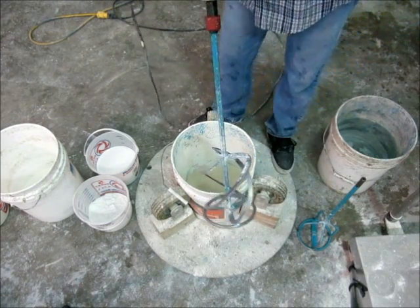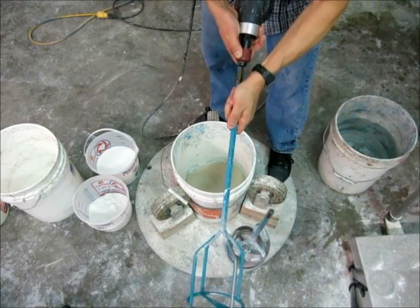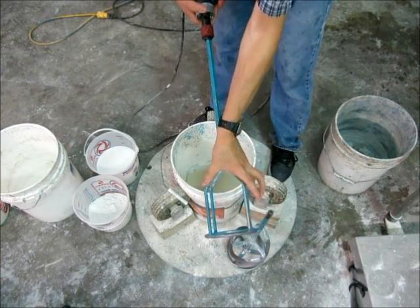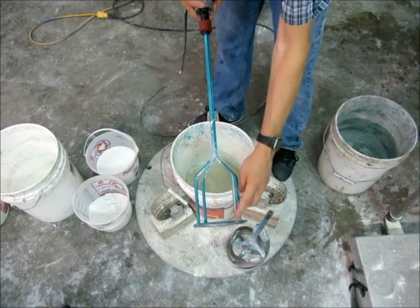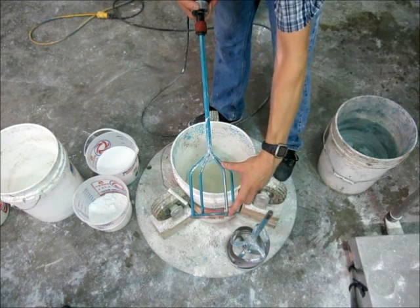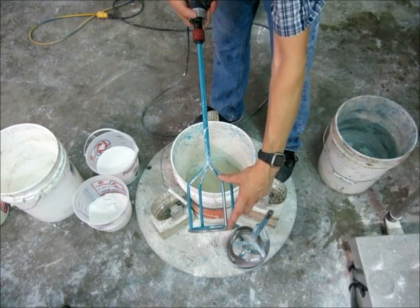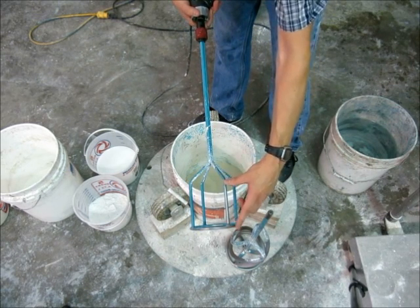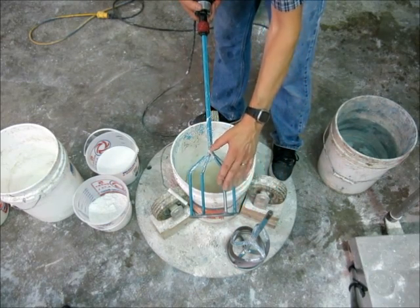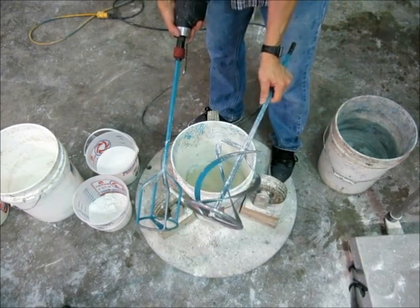What I found is that this paddle — which is straight sided; this is the 140, and we're going to be replacing it with a 160 which is a larger diameter footprint — this style blade, because it doesn't lift the material, it just flings it outwards. These vertical sections shear the material extremely well and you can spin at full speed, the full speed of this tool, and get excellent shearing and mixing action.